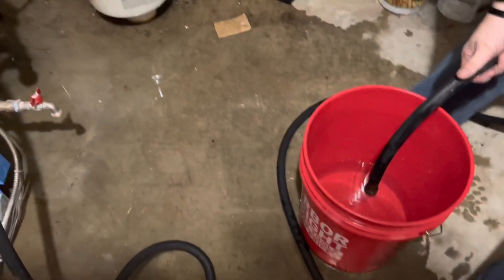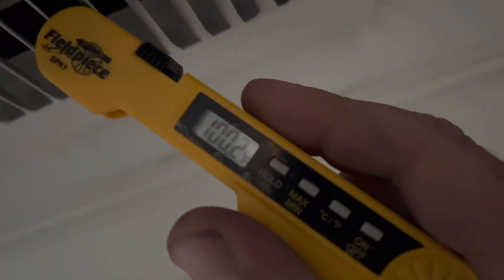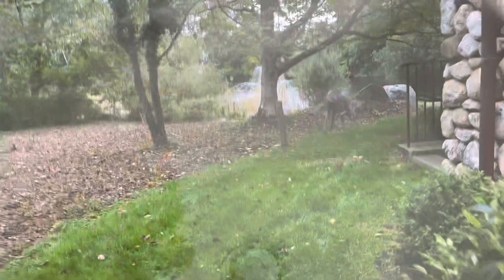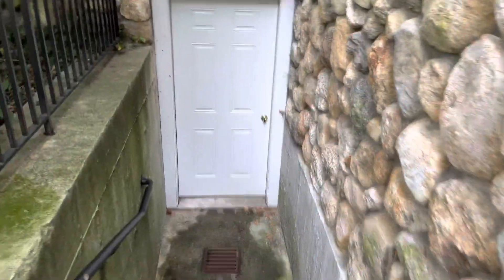Can you go upstairs and we'll check those supplies now because we're hot and the boiler's hot. We're going to check the thermometer, see what heat's coming out of the vents at the supply. 109.6 there — that's good on that loop. Going to go to this thermostat and check the master bedroom. Just make sure it's calling. 78 degrees coming out of that supply. Those two zones are good. Now we're going to check the hot water — that's good there.